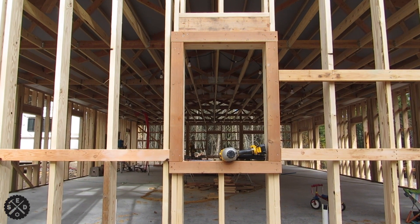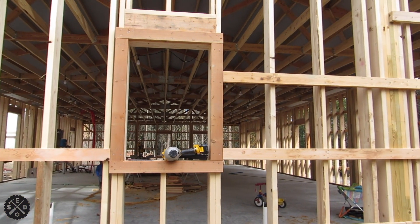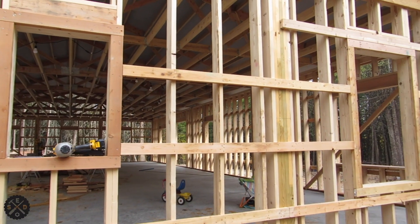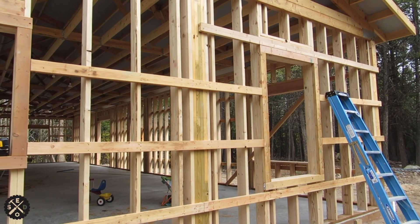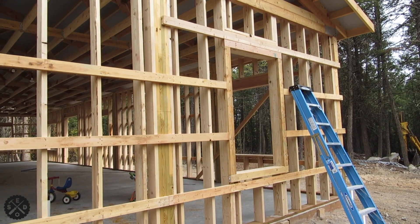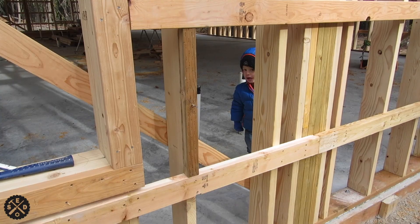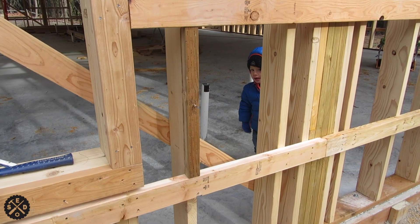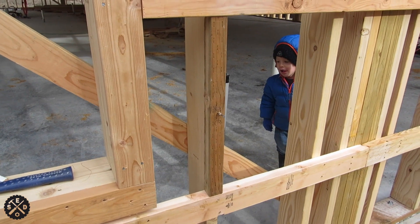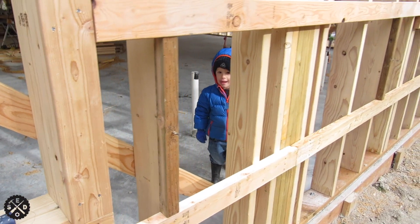Here's an example of what I had to do: I framed around the window with 2x4s and then ran my other ones against it. I wanted to figure out my spacing so my 2x4s came up right on top of the window, and that gave me my spacing. I made these blocks for spacing the 2x4s — I just stick a nail in it, pound it in, and it works really nicely for spacing.